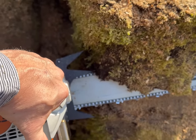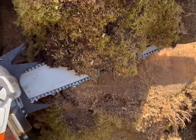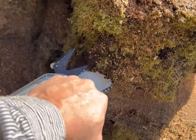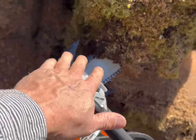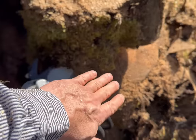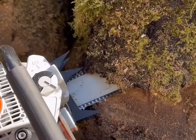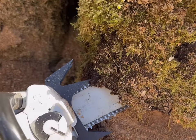In theory you can put that point right where you ended that last cut and go ahead and make your turn, and it will come right up to where the back of the last cut was and your faces will pop right out. That's one really nice feature of the three points.